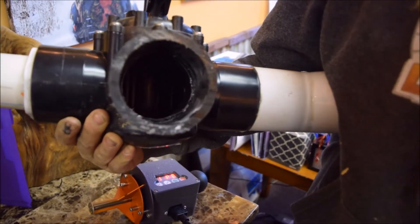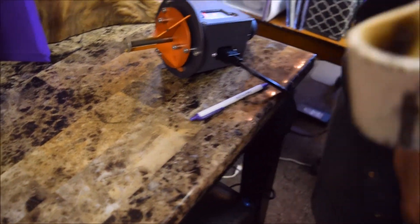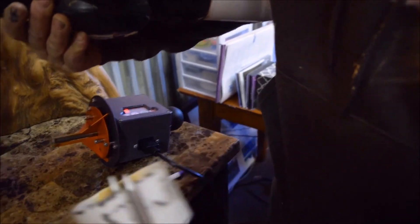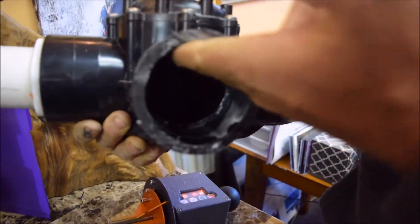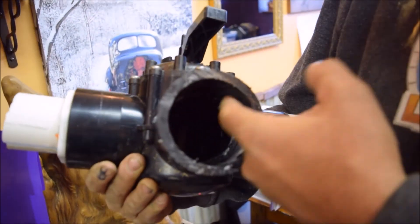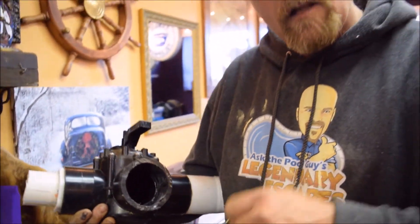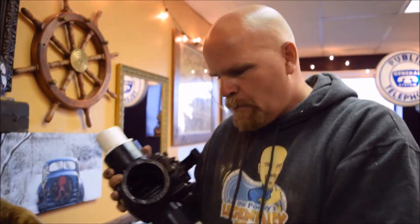Here's the piece — it's still warm; you can see how it disfigured as I twisted it out. The unit is barely warm to the touch and is clean. Once that cools off, we can go ahead and clean it, prime it, and glue another piece in there. This debonder is good from half-inch up to three-inch pipe. They also make one for four to six inch, and one much bigger for larger pipe.